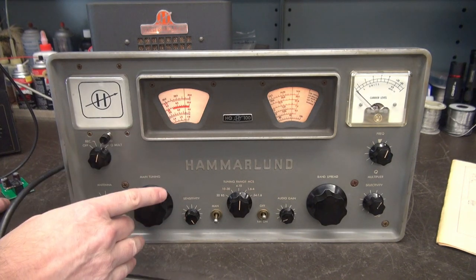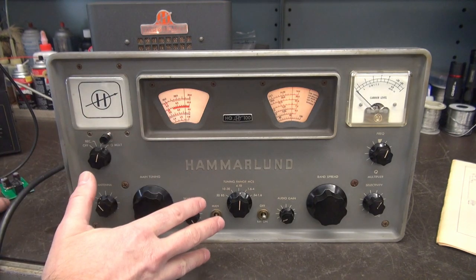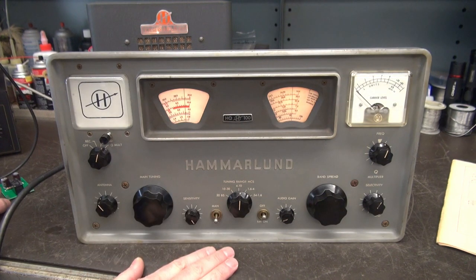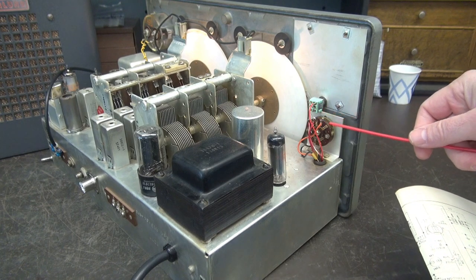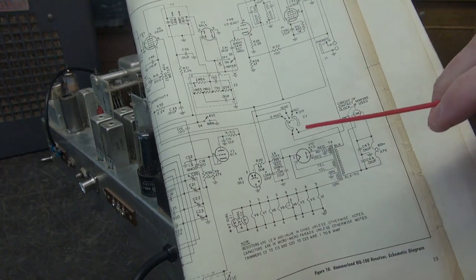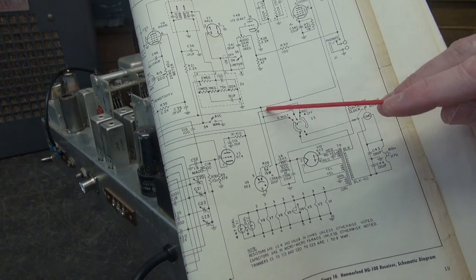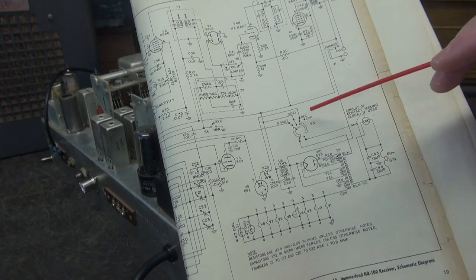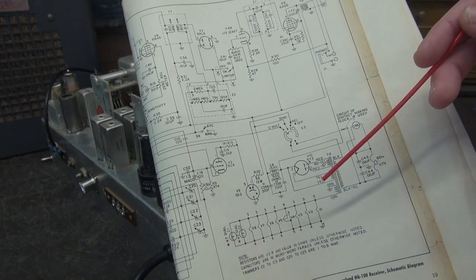This receiver does not have those rear jacks. There is a standby function, but it's limited to just the radio, so to operate a transmitter with this radio would be a real challenge. But I do have a solution. There is the rear of that receive and send switch. Schematically, you can see that send/receive is in line with the power supply — it simply turns off high voltage. Some guys would hook across these two terminals and run wires out the back of the radio through their TR switch.